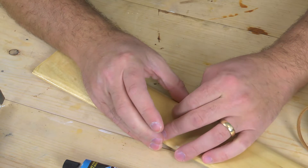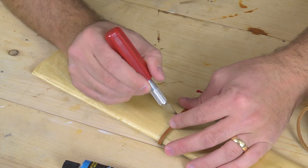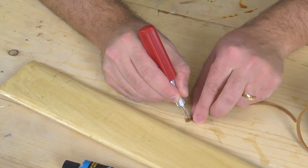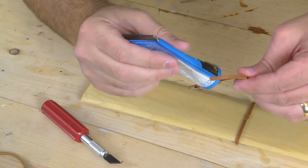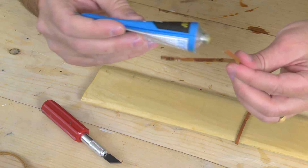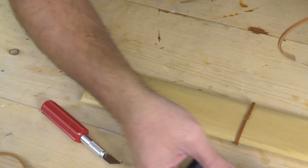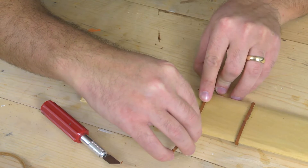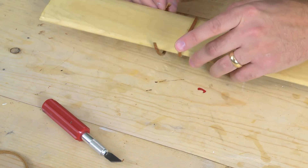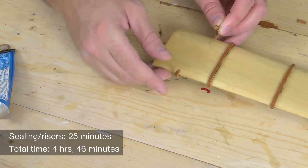There are obviously other types of glue you can use, but I wouldn't use a water-based glue. You want something that's going to bond well both to the leather and to the varnished or polyurethane wood — something pretty strong with both materials. Cut these out — they're just leather strips or leather lace. You can make these yourself or just buy the lace, and make sure they're pretty well glued before attaching them. This glue dries really quickly, so it is possible to get these on crooked if you're not careful. Use a ruler to draw a clear line. Make sure all of the seams are on one side — the back or front depending on orientation.